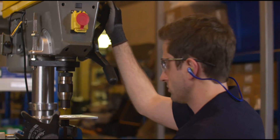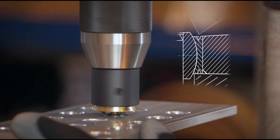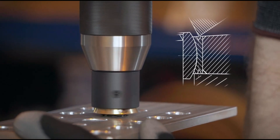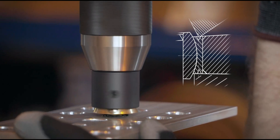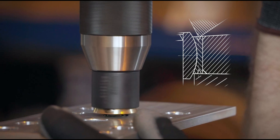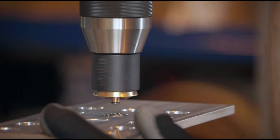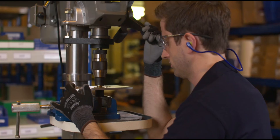For the primary swage, start the spindle and slowly apply a gentle and gradually increasing pressure so that the rollers center on the bearing's V-groove. You are now swaging. Repeat this several times, maintaining engagement of the swaging tool for around 5 seconds.